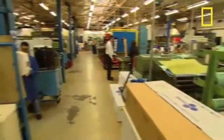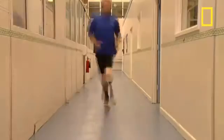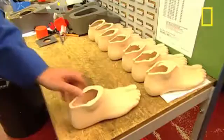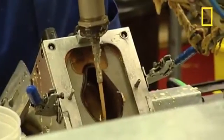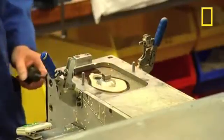This is how a company in Basingstoke, Hampshire makes prosthetic legs. They start at the bottom. The chemicals isocyanate and polyol are mixed together to make a rubber compound, which is injected into a mould. One minute later, a hard foot appears. Nine different sizes are available.